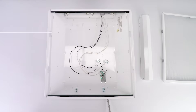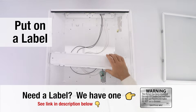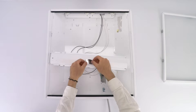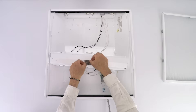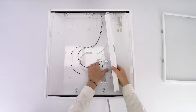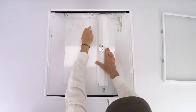Put a label on the cover where the ballast was. Make sure you get a label there so people know in the future that this light fixture has been converted to a double-end LED tube, and they won't get confused and try to put fluorescent light bulbs in there. Now all you need to do is cover up all the wires, tuck them underneath, make sure they're not pinched, and you're ready for the next step.